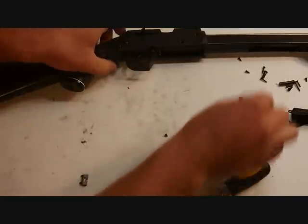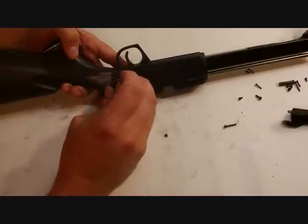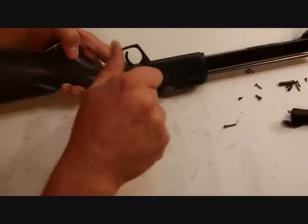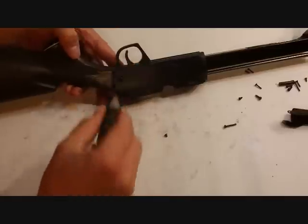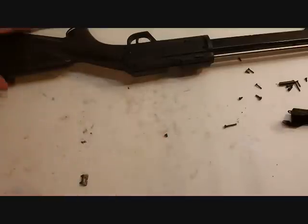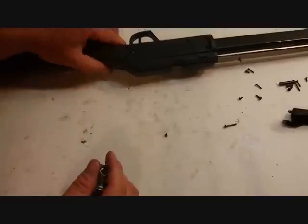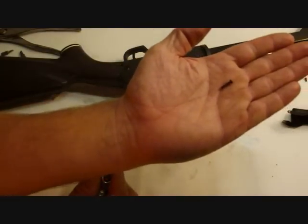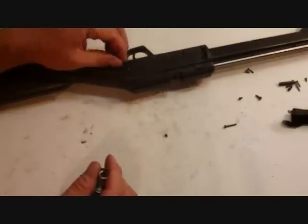All screws on the 880 are regular right-hand threads. So it makes no difference if you use the screw on the left hand or the right hand side, as long as you have the correct style of screw. The next style screws used on the buttstock are the second longest screw. There are four of these screws on each rifle.